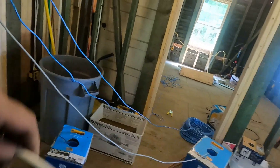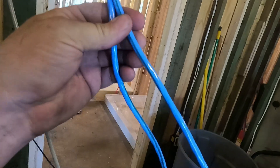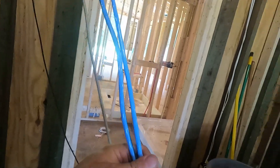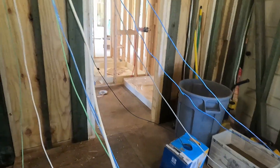This is the coax — there's only one coax. We label them anyway, label what everything is. Then we've got three different Crestnet wires, also known as Lutron green. That's that Crestnet I showed you earlier with the four conductors in it. There are three of them: one for each window and one for the keypad. You label them on the end before you run them, and then you label the box with whatever it is. So when you cut these back to length, you label them and you know what they are — that's how you know what each wire is.